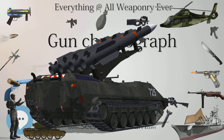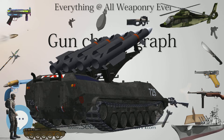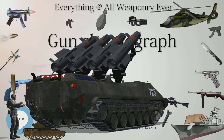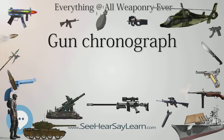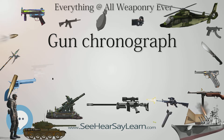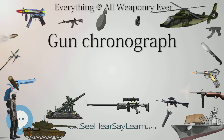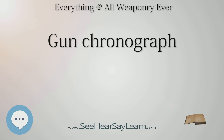The first electronic ballistic chronograph was invented by Kiryako Jerry Arvanitakis in the 1950s. As consulting engineer under contract by NACA, later NASA, he was asked to find a way to accurately measure the velocity of various projectiles fired at hypervelocities into a variety of engineered materials in anticipation of manned space flight. His first design was an open rectangular frame of square aluminum tubing with a screen of fine copper wire at both ends. Breaking the first wire started charging a capacitor; breaking the second wire stopped it. Measuring the accumulated voltage and knowing the rate of charge, the elapsed time could be accurately calculated.